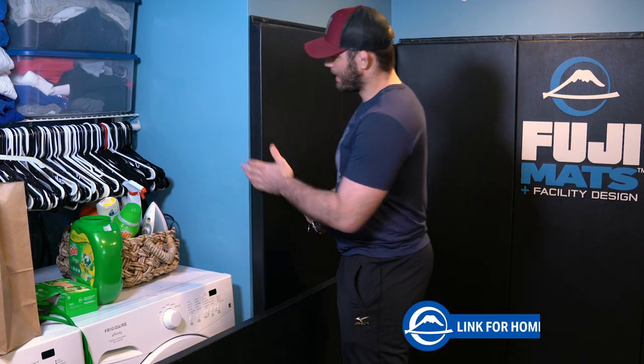Open up the package and get a sharpie to mark your spot. Everyone's going to have a different place on their wall. I'm fortunate that my wall pad ends on a corner piece here in my home gym, and I know there's going to be a stud in that corner. Everyone's home has different types of studs — some metal, some wood. If you have a metal stud, you won't be able to use the screws they give you; you'll want to go to Home Depot and get a self-drilling screw that goes straight through metal.